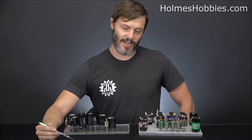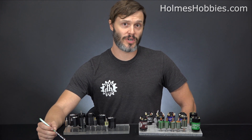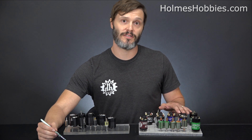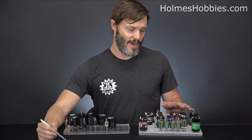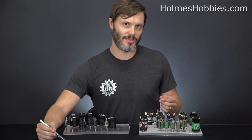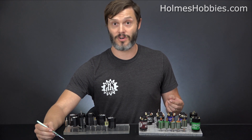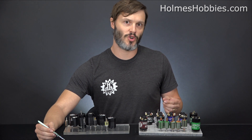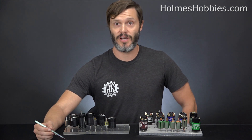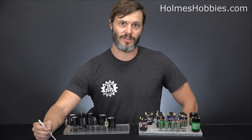What's the bad side about a brush motor? You have lower power density and lower torque density, both caused by the brushes themselves. The brushes are always going to be the same size, so when you ask for more torque and have more current going through, the brushes drop more voltage as current goes up — that's really your biggest choke point. It creates heat and reduces your ability to produce torque at any point in the throttle.